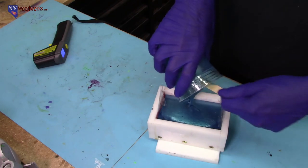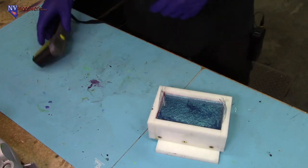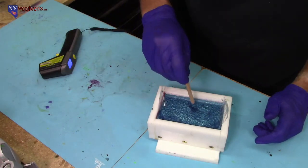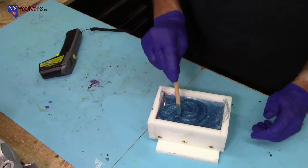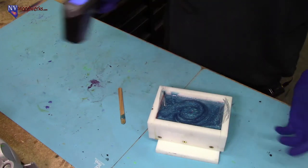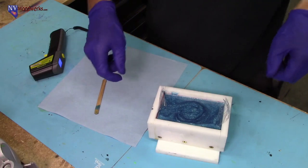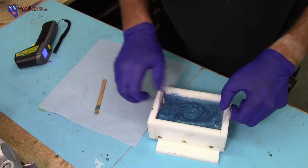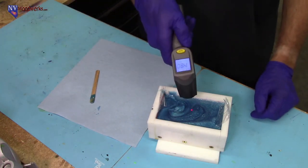It's getting pretty thick. I think what I'm going to do is pour it in here and take the temperature sitting in the mold. 143 — let's just wait a little bit. You can kind of take your mixing stick and see what the viscosity is. It's still fine, still open. 147 — we're getting close. Probably not a bad idea to put something down, because we're going to have to pull this thing out and just stick it somewhere so I can get it in the pressure pot. 150.